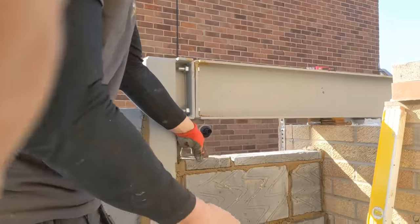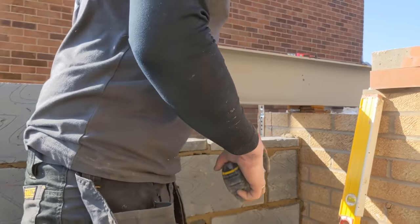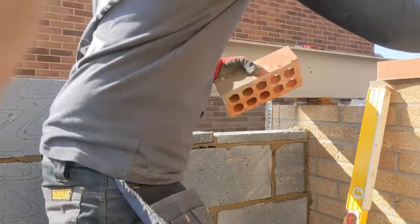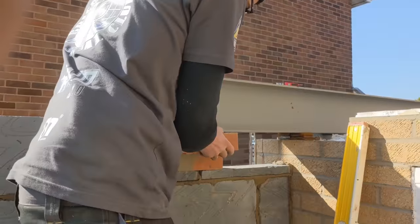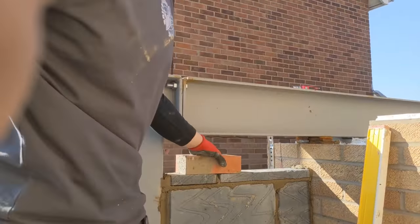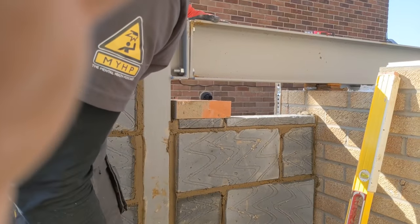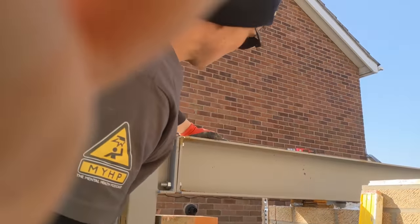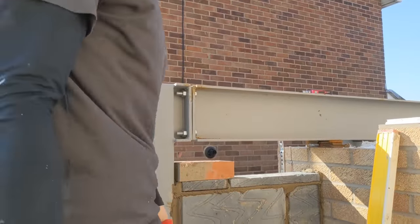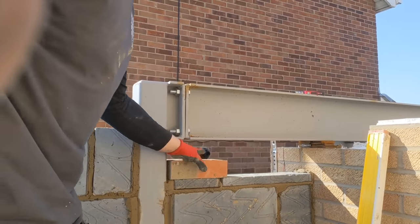This is for you, Drew. So every time we've got a steel, you're meant to put a padstone under it. We've done a couple of knock-throughs now where we've done padstones. Here, I've put a cut on to get me to working bricks. I've got two engineering bricks under it. If you weren't to put strong bricks — like engineering or blues — the block would probably crack over time because it's got so much weight pushing down on it. In all fairness, this steel is connected to this, which is a padstone in itself — but it's good practice to have a padstone under a steel, so regardless, we're going to put one on.